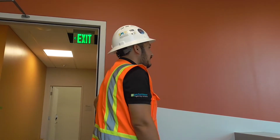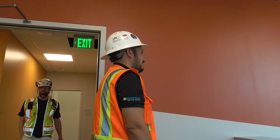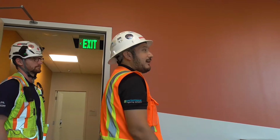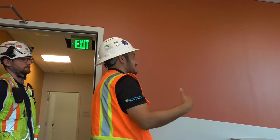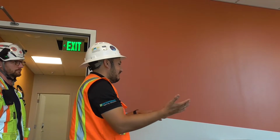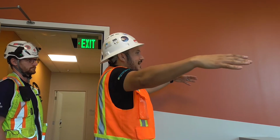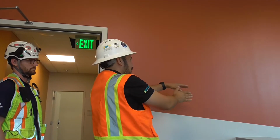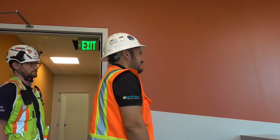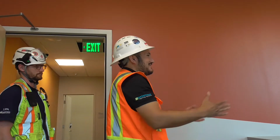Because we have issues in other buildings where people are sitting at a desk in the row, and it doesn't pick them up, and then the lights turn off on them. Depending on where that's at, you can manipulate the PIR. I don't know to what degree; it's already set as high, but sometimes you have to look at the environment, because if they're sitting low, and I've seen this with cubicles, the detection comes out as a cone. If the cubicle comes up this high, they're probably right there in that blind spot. So sometimes we can raise it up, but sometimes it's not going to happen.